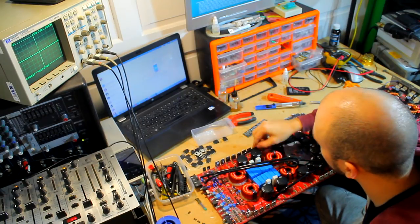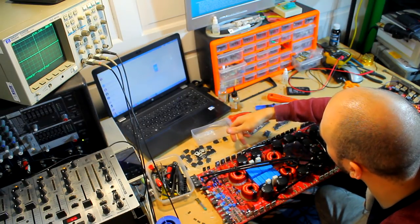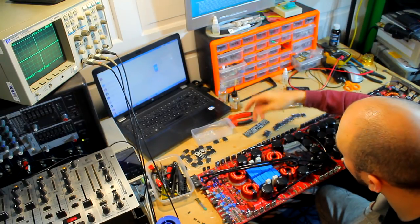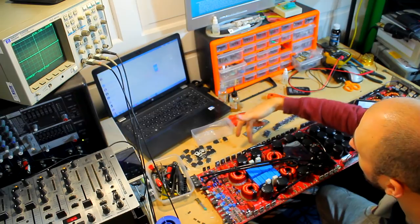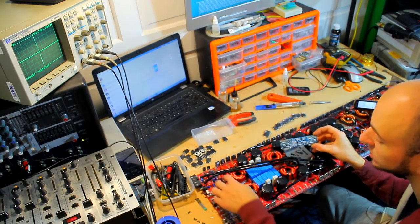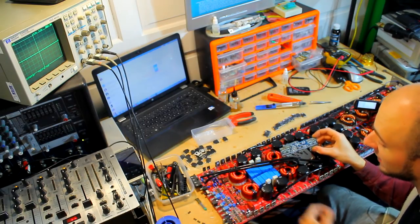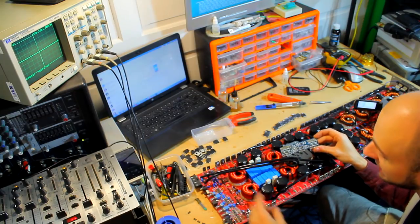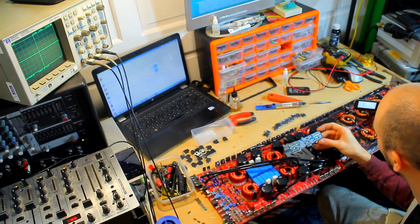So I was able just to pop a fresh one single FET in this side, and they are still the exact same batch, but it did kill the driver on this side when this single FET blew. So we've taken the driver board out already, and it was on headers, which is very handy. Previous repairer obviously put headers in, nice, good job. Means it's easy for us guys, we haven't got to go ahead and solder the driver board out, which can be a bit of a headache.